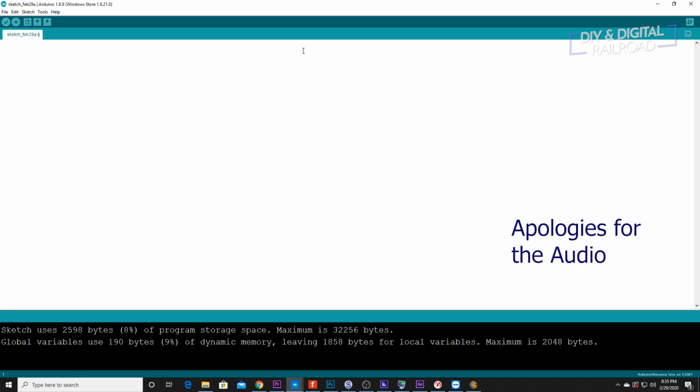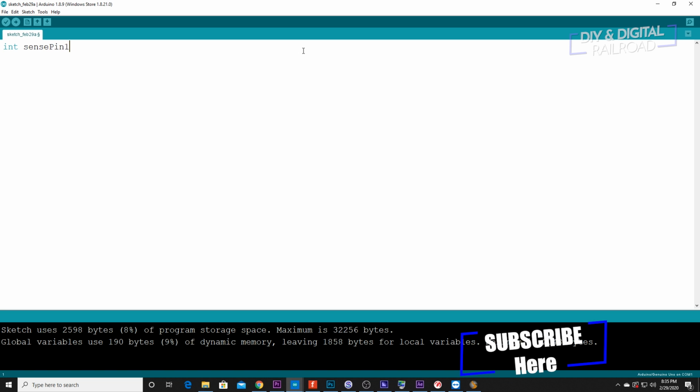Okay everyone, we are in our Arduino IDE and let's get started. So the first thing we need to do is declare some integers. So we're going to do integer sense pin 1 equals A0. We'll go ahead and say that declares A0 as our sensor 1 input. Then we'll do sense pin 2 equals A1,